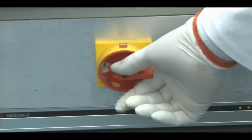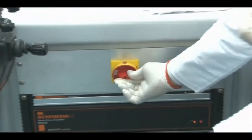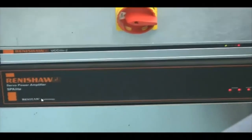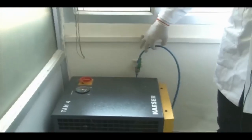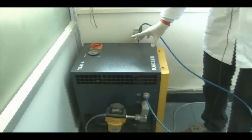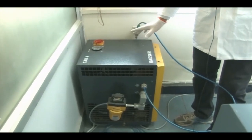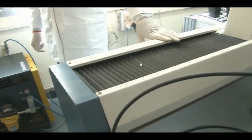The movement relies on airflow between surfaces, which compresses and produces a spring-like motion so the machine can move from side to side. Air film flows due to completely dry air. This is the controller used to switch the compressor on and off. We have a Renishaw servo power amplifier. The compressed air comes via a tube pipe from a refrigeration-type air compressor that is 100% moisture-free, so it will not harm the machine.